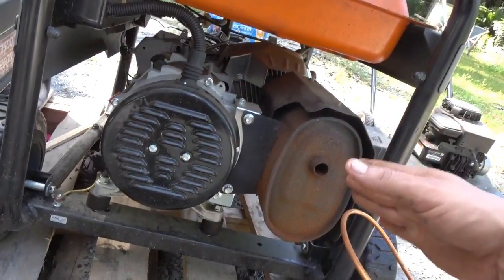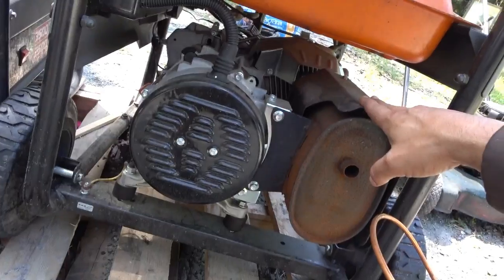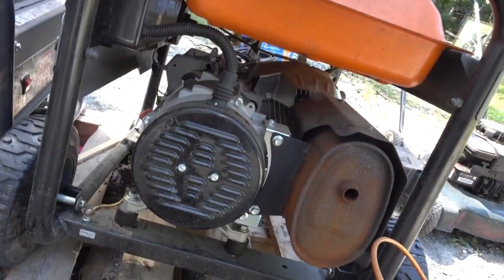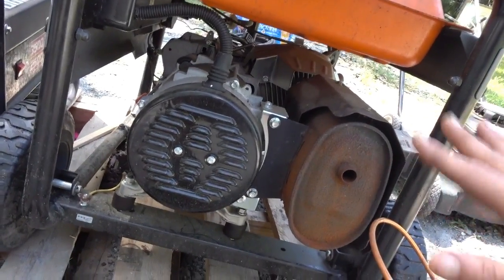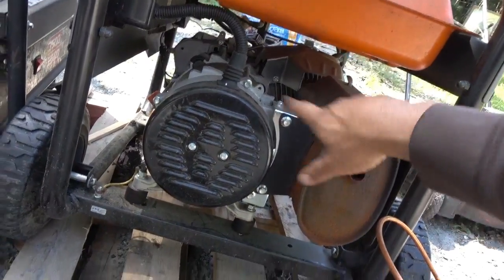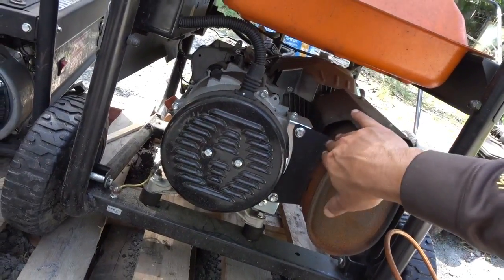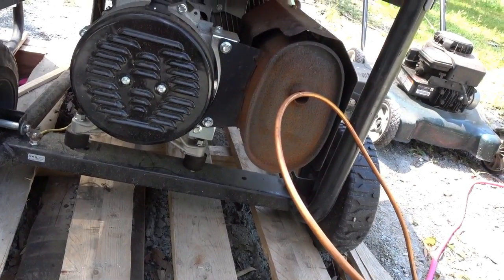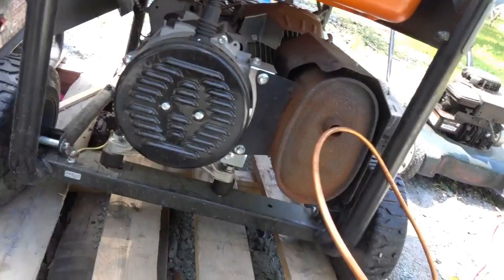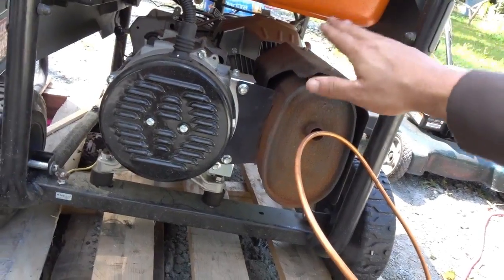The idea is, if you have a hurricane and your power goes out for a couple days, you would run this to power your house. And instead of spending 4,000 or 5,000 watts on an electric heater — by the way, there's a little hack I can show you for that later — you're going to just use this for your refrigerator, your lights, whatever you need, maybe a small AC unit. And the heat that comes off of here is going to heat this up, circulating right into our water container. It's massive heat that's there — you're going to be taking the inefficiency of this engine and using it to heat your water.